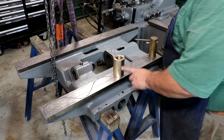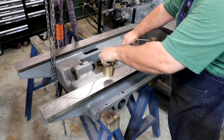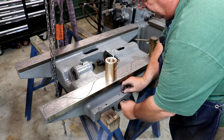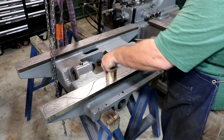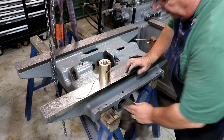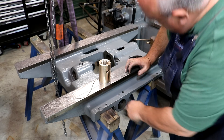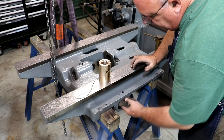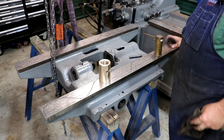So I think we're about ready to put this in. The bearing is going to slide up in here. You see the notch, and you see this hole that is lined up. We'll probably have to run a tapered reamer down it to get it lined up perfectly. But this pin basically drops down in - this is a tapered pin, so it's going to be tighter and smaller on the bottom than the top. That will hold it in place, keep it from turning, keep it from coming in and out. I want to start by just cleaning this out, make sure there's no trash in there, and put a little bit of light spindle oil in here just to give it some lubrication and help protect from any corrosion.